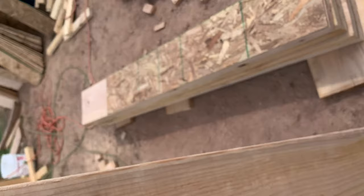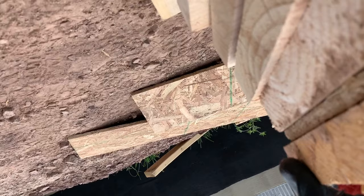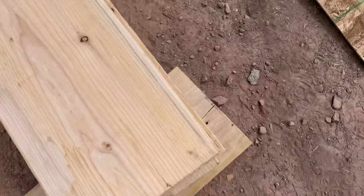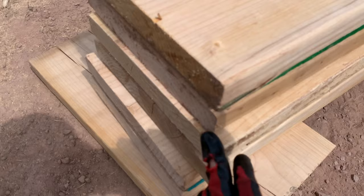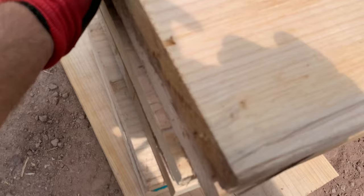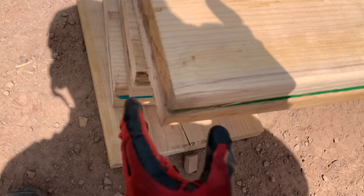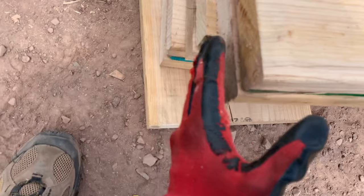This side has the cup, so we're going to lay that on top. The OSB there is short, but I'll show you what to do to make it easy. We've now made kind of a sandwich. Just like with the jacks, make sure it's flush on the edge. One side should be flush with the other — the reason you can't always get both sides flush is that boards are often slightly different thicknesses, like 11 and a quarter versus 11 and three-eighths. Make sure it's square on this side as well.